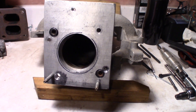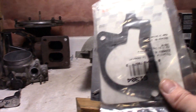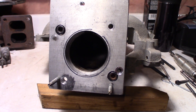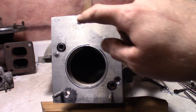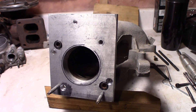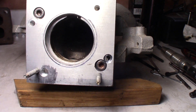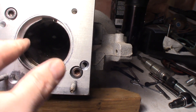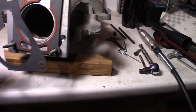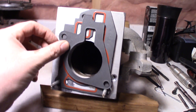You can also make the adapters work with the 3100 or 3400 — you just have to drill your holes in different spots. Basically just take your gasket, use that for your template, drill your holes and counterbore them. These are M8s; the smaller ones are M6s. So it's just another option for you guys looking for a bigger throttle body upgrade without spending a whole bunch of money. The problem with the 3100/3400 large port plenums is they'll have to be ported as there is quite a bit of restriction there. Also, you will have to trim your gasket once it's bolted on to match the opening of the plenum and the adapter.